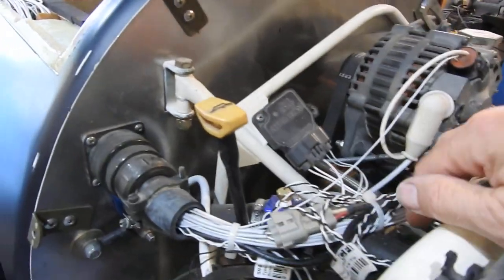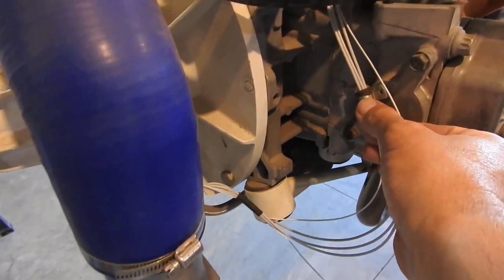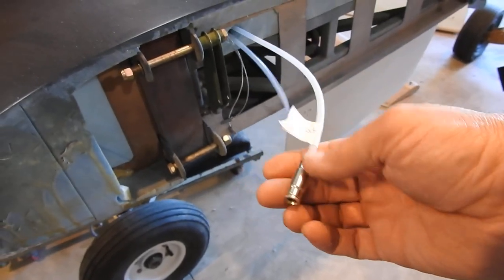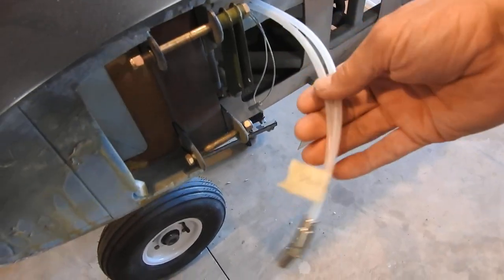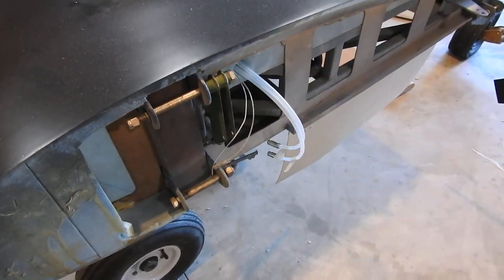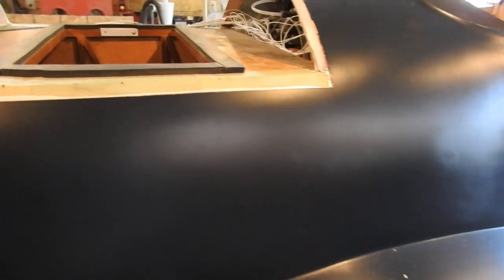I finished the wiring up here, finished some wiring down in there, tied everything up in the airplane, safety wired everything, got everything rearranged to where it's good to go. I got the clamp I need to mount to hold this to the mass airflow meter but got everything lined up. The two tubes I ran come out right here — those are the disconnects for the static line and the pitot. They're longer than they need to be and will be cut after I get the wings on. These will also be the wires that go out to future wingtip nav lights.